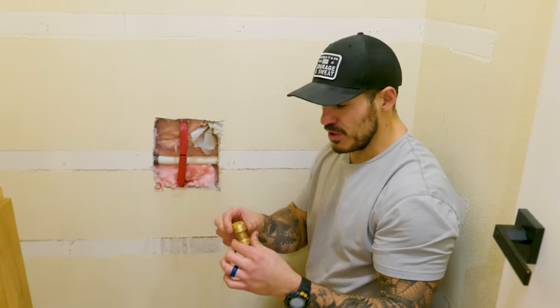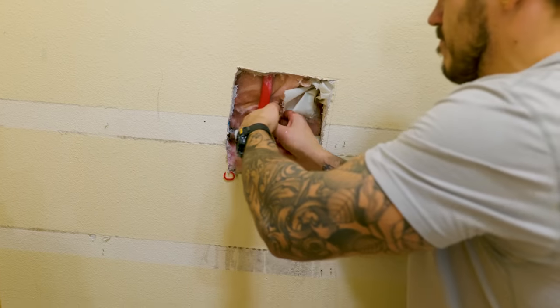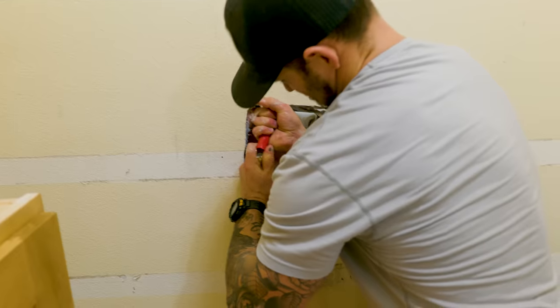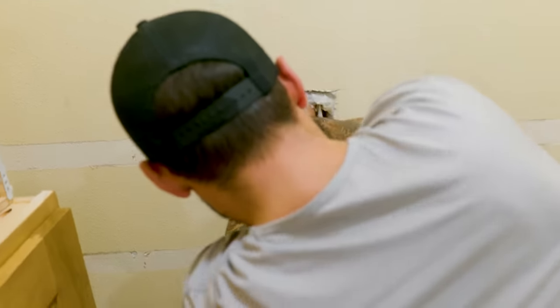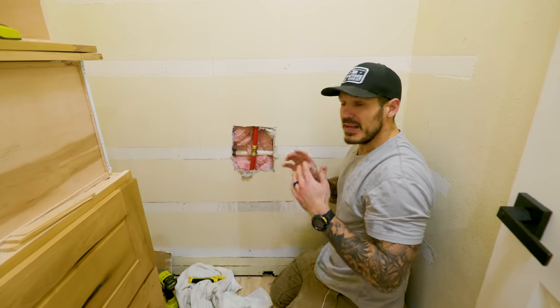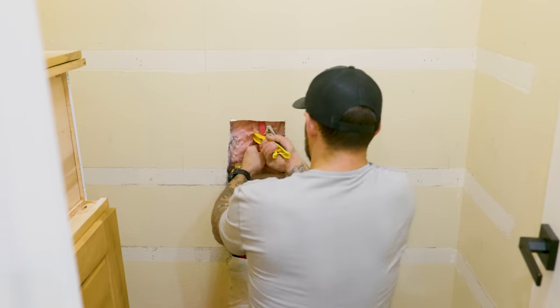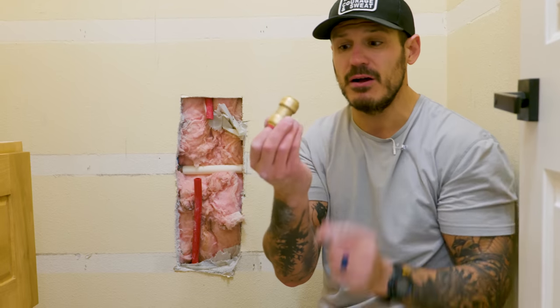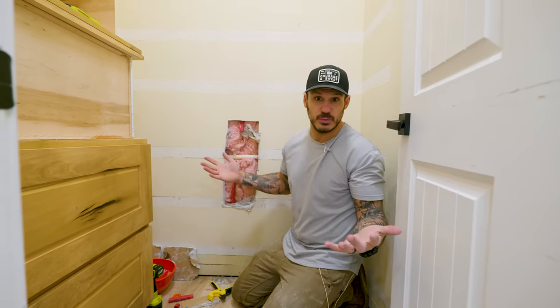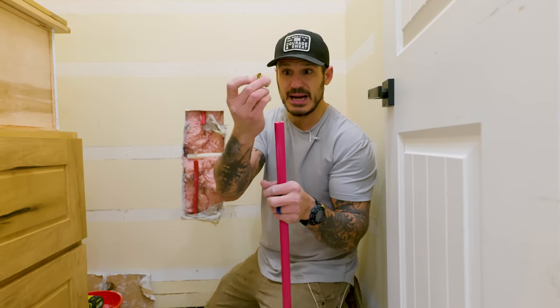All you have to do is slide it on all the way down — once it's on, it's not coming undone. Now, the off chance you may not have enough slack to slide this safely on to create a watertight seal — not to mention some plumbers actually hate the SharkBite, saying they fail over time. So I'll show you both methods. The method they guarantee is doing it the old-fashioned way.